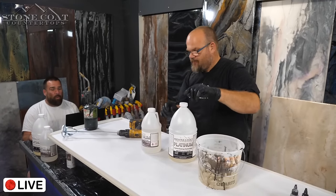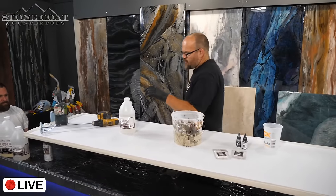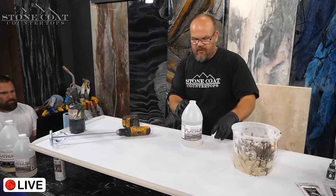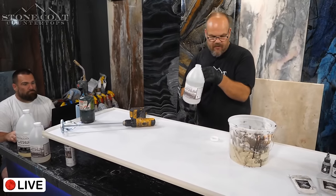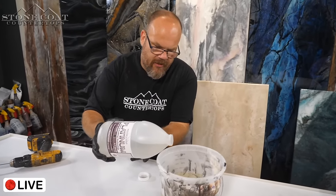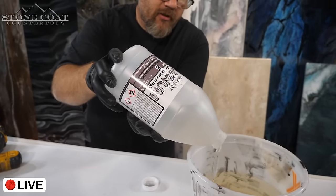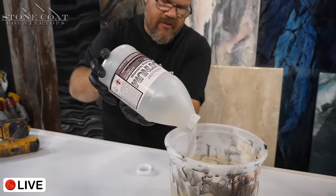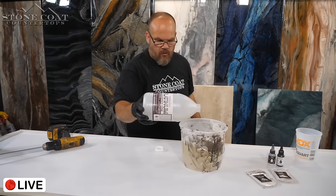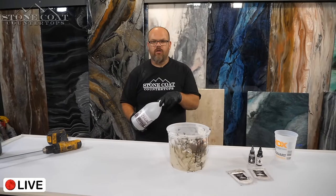Sorry, bro. Hey, well, Mark's asking, does silicone mess with the epoxy? Absolutely. A lot of artists use silicone to create cells. And the problem is it's a non-adhesion promoter. It's not going to allow things to stick. And it spreads, man. Silicone spray, like Luke, you installed garage doors, right, before you started working here? Luke had his own garage door install business. Did you guys use silicone spray on the track to lubricate the doors? Yes, we did. So the problem with that is when you spray a silicone in your shop, it gets airborne, man. It goes everywhere. You don't even know it goes everywhere.